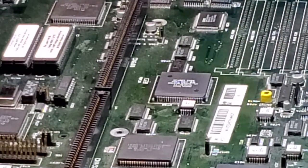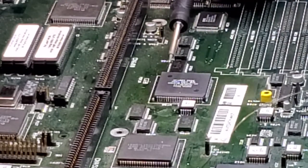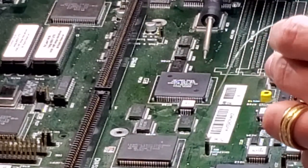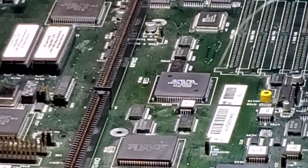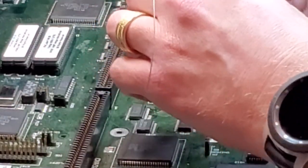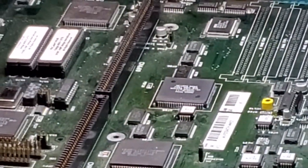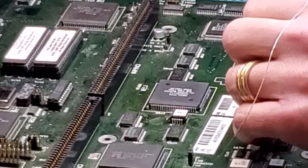I'm also using a micro soldering pencil for this. Some people prefer to drag solder, some people prefer pin to pin. If I'm just doing a single chip like this, I prefer to do pin to pin. This is a Hakko FM2032. It's really small, as you can notice. It really helps to get the pins perfectly in place without creating too many bridges. So hopefully we can get this where you can see and I'm not going to be in your way here.